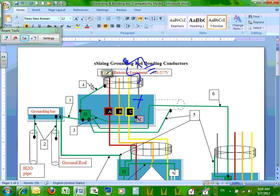Any question? So, could you give us just a quick example, like let's take the 208/120 system. Okay. And we lose the neutral. Everything that is line to neutral is shared, they're sharing 208. The fattest, fluffiest piece of equipment is going to take the largest amount of voltage. Out of the 208, it's going to take 200 volts, exaggeration, maybe 180. The smallest piece of equipment is going to take the leftover, which will be what, 28 volts or something.